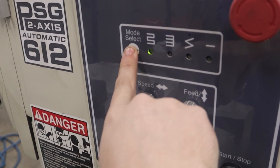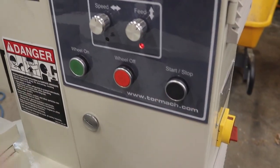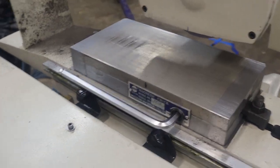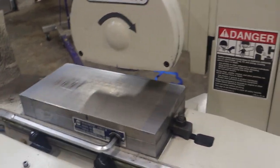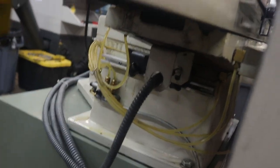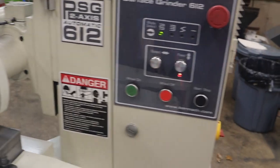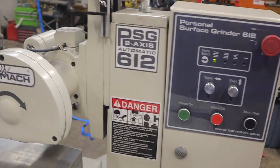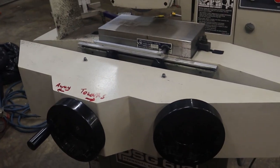There are these mode functions — patterns, if you will. It'll follow the pattern you have set when you hit the start-stop button. To adjust the limits of travel there are these knobs, and there's a pickup in the middle. As long as you start in the center, the table will move between the two pieces of metal. The red light in the Y direction means the sensor has picked up the stops down here, so you can just move the Y a little bit until that turns off — meaning you're in between. Then go ahead and hit start-stop, and this is how it works.